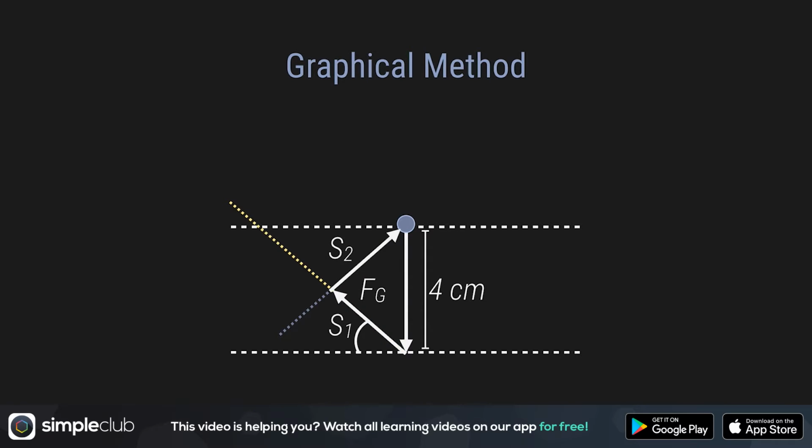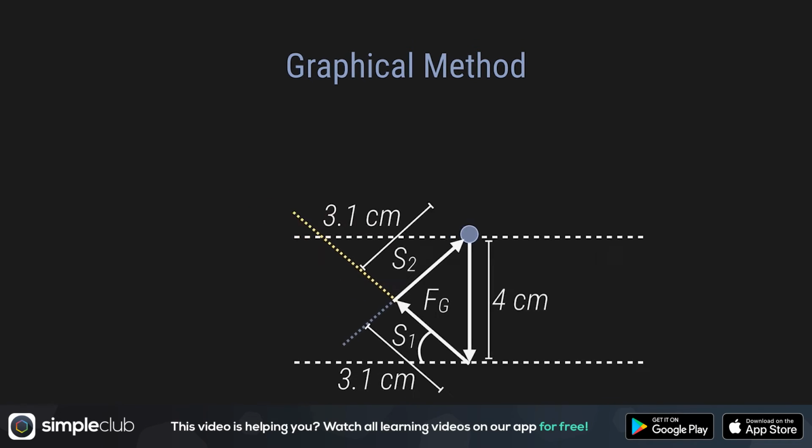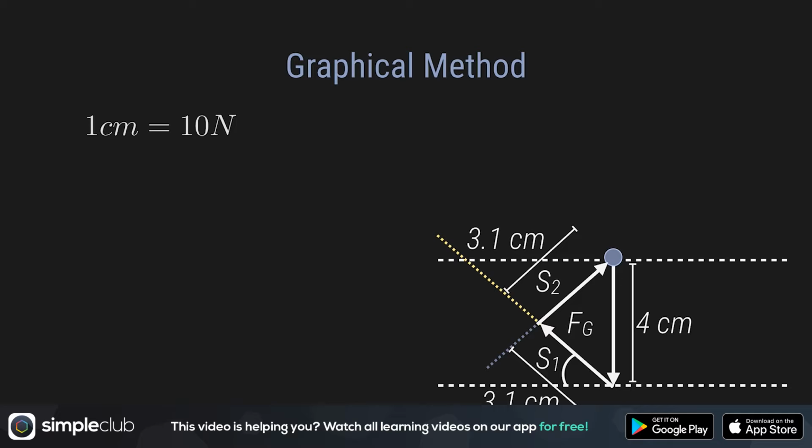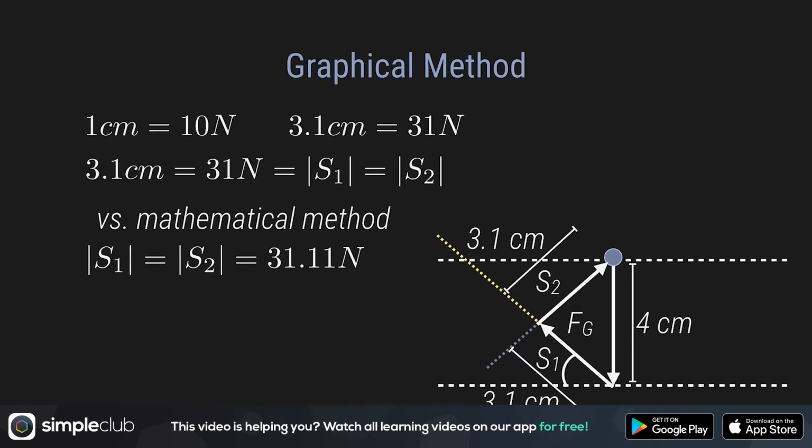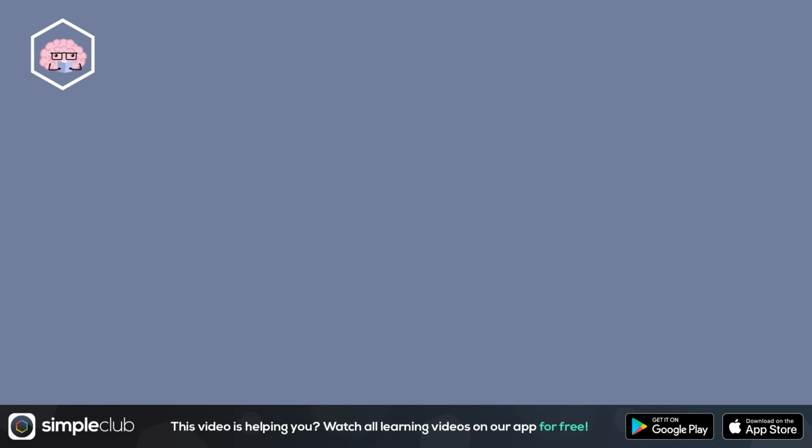And that's it. The lines of action intersect one another, so now we know where the force for S1 ends up and where the force for S2 begins. And since we are so mind-bogglingly precise with our drawing, now we can just use the ruler to measure the magnitude of the forces. So when we started, we said 1 centimeter equals 10 Newton, in which case 3.1 centimeters equals 31 Newton, which is pretty much what we got when we solved the problem using math. Well, that's that then.